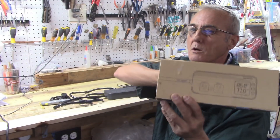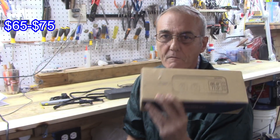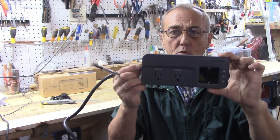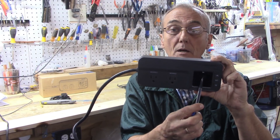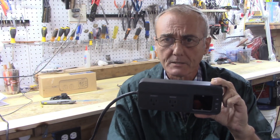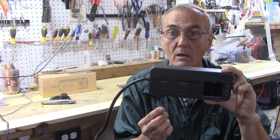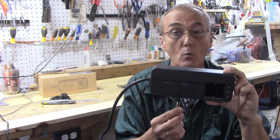These are going to run you about 65 to 75 dollars on Amazon — very well worth it if it fits your process. It comes right out of the box looking just like this. It's got a screen with the set value and the PV — the process value, which I call the perceived value because that's what it senses. You've got work one and work two: work one is heating, work two is cooling.